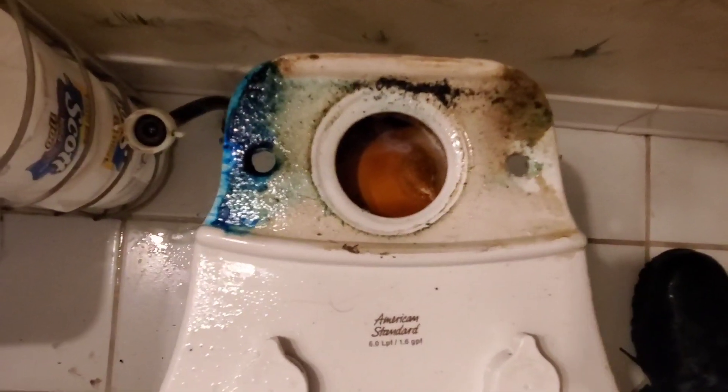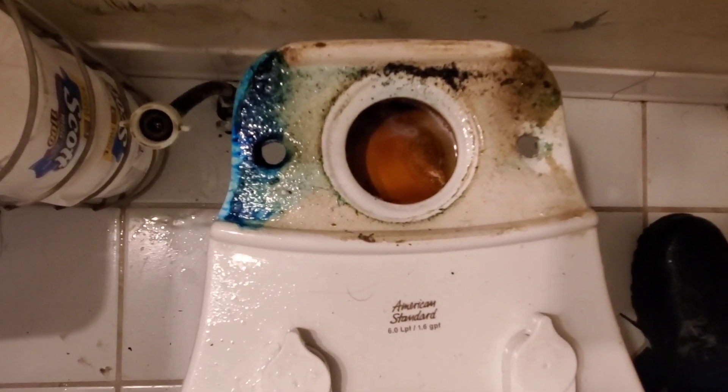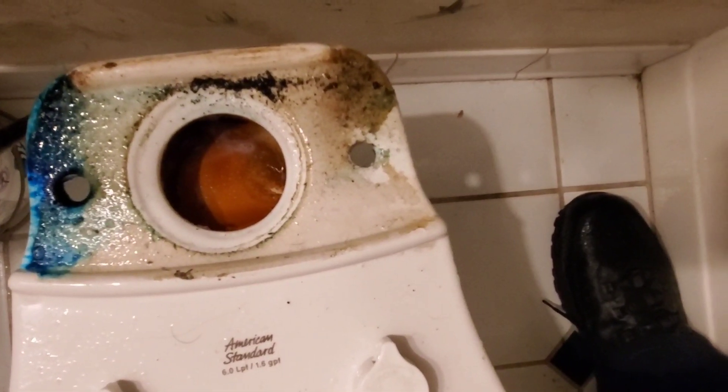You can see where the leak was on the left side — the blue dye shows us clearly where the leak was. Over on the right side we also see a little bit of evidence of a leak. With all new hardware we'll clip it up.